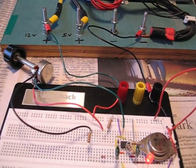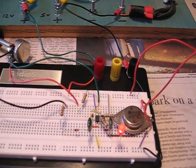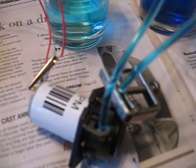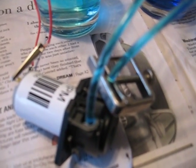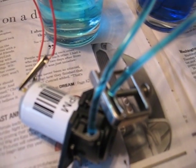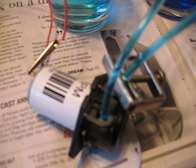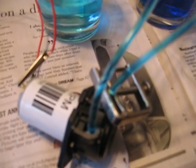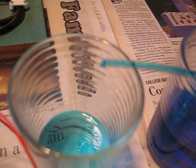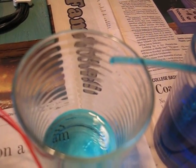I found it best to keep the RPM of the pump up adequately so the pump is functioning well, but go ahead and pinch off the outlet with a Hoffman clamp in order to control the flow rate. If you do it strictly with the rheostat on the control circuit, you're down on the very ragged edge at a low flow rate like this. You get a much steadier flow rate by just providing a little back pressure with the Hoffman clamp.